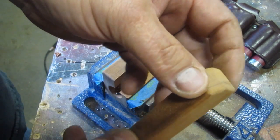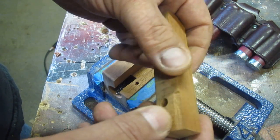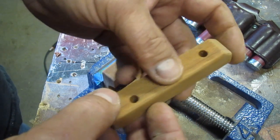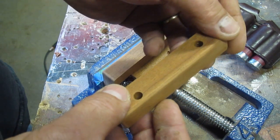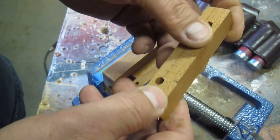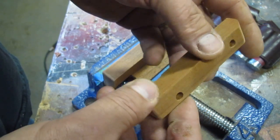This is Sapele — I just wanted to show you this up close. Sapele is really an interesting wood. It's a lot like mahogany in its appearance, and it sands very easily and machines beautifully — just no burning. It's got short fibers. But unlike mahogany, this is not soft.